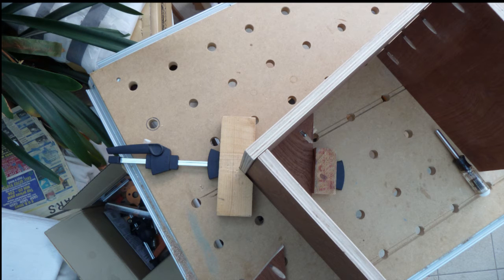There is one other thing I can point out in this picture. Sometimes joints held by pocket hole fixings in thin material seem to wobble. Even when the screws are tightened as tight as you dare, they don't seem to screw up tight. Well, look here. Can you see the light coming through the joint? The joint is held apart by material brought up by the action of the screws biting into and displacing the wood of the underside of the top. You can't tighten the screws anymore or they're going to strip.